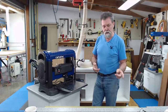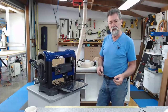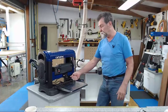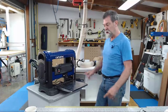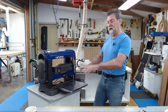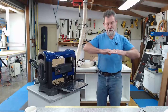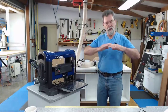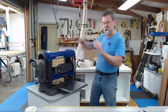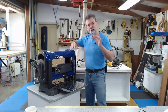The second way which you can do is, as you're pushing timber through the machine, throw in a couple of sacrificial pieces as well. So they're just going to tail along the same thickness always. So you push your timber through. As it's going through and it's getting near the end, you put those other pieces of timber in to follow it. And what happens there is that it holds everything steady. So you've got an overlap. There's no chance for the timber to drop up and for the rollers to have less effect, because the rollers are still getting the consistent amount of pressure down because they're being held up. So that's one other way.